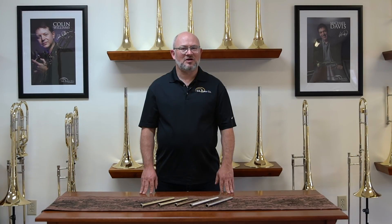We get a lot of questions about our vintage Elkhart lead pipe, which is modeled after classic lead pipes from Elkhart instruments. This is equivalent to a 2.5 short but with a Remington receiver, which is a different taper to the shank of the mouthpiece than most standard mouthpieces used today. If you use a standard Morse taper mouthpiece, it will fit much deeper in the vintage Elkhart lead pipe than in other models. We recommend that you only select this if you know that you use a longer shank or Remington shank mouthpiece.